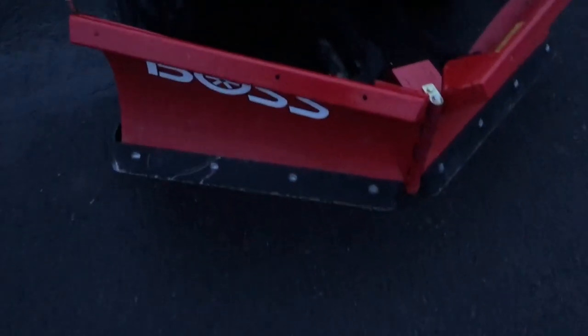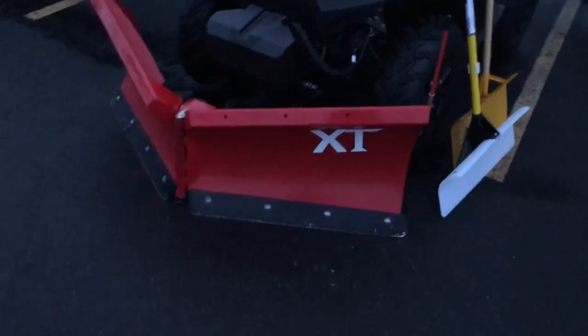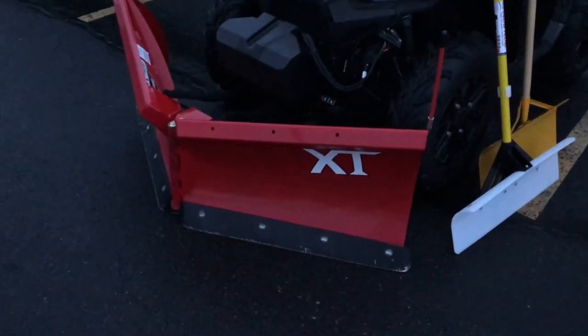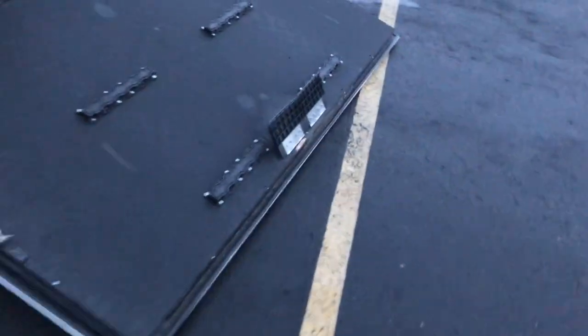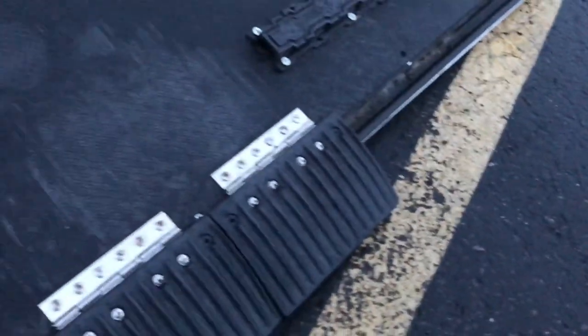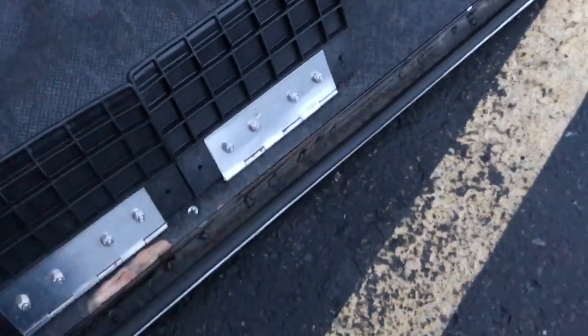You don't need the top little flaps up there — I'm not a sitting-down plowing kind of person, I like to stand up and see what I'm plowing, so I find them kind of pointless. The snow doesn't fly over. I had to add some plates on the back because the Boss plow was chipping at the panels. I added some folding pieces at an angle so it just slides up and hits those instead of the wood, hopefully making them last a lot longer.